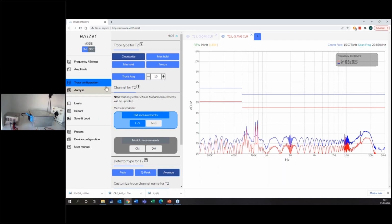If your goal is to minimize the size, then what you have to do is take in smaller components, maybe with better performances. But if your target is price, then maybe you allow bigger components which are not so good in performances. But still, you need to make sure that when you go to the EMC lab for the final stamp, you pass. If you get a fail, you've just lost time, money, and spent a lot of time